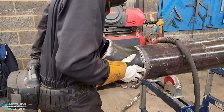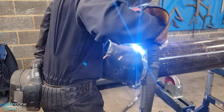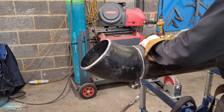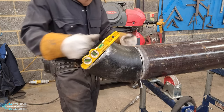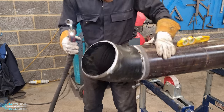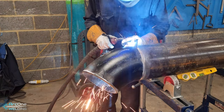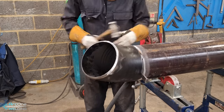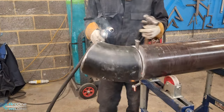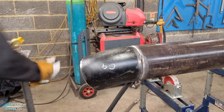Hello all and welcome back to my channel. Apologies on the wait for a pipe welding video — I know most of you subscribed because I make these pipe welding videos, and recently I've been doing unrelated stuff: reviews, house videos and things like that. Rest assured, I have a video for you now. This here is a rolled 6G weld — is that such a thing? I don't know — but it's a 45-degree position weld that is being rolled at the same time. This was an experiment; I was trying to see how it would come out, because anytime I chop 45s into 22.5 degrees I always roll them and they come out nicely. I've never quite done a 45-degree before, just because I was worried about how much the pipe would sag, but it came out nice, and this should be entertaining for you lot to watch.